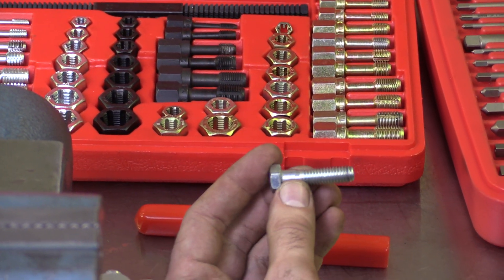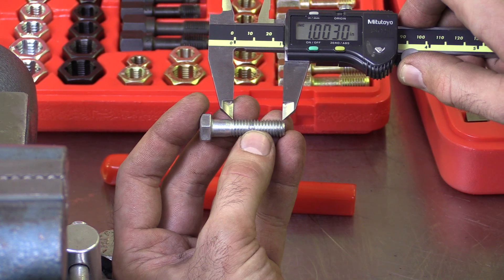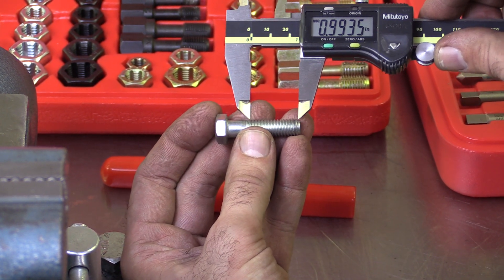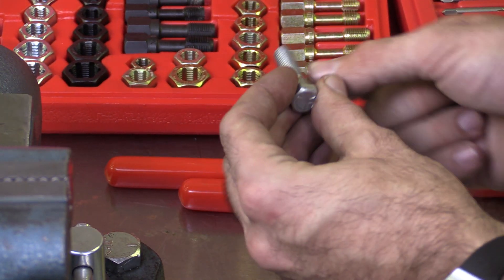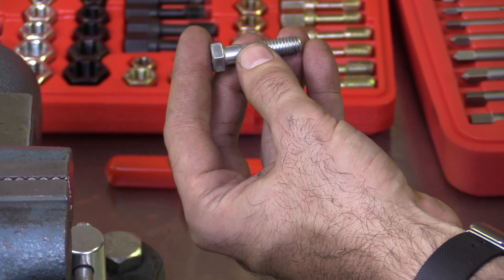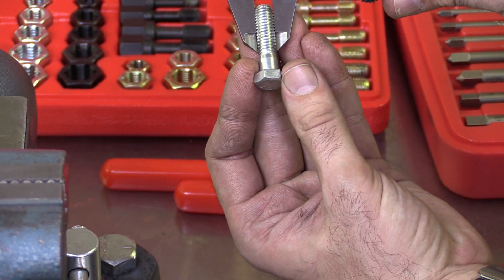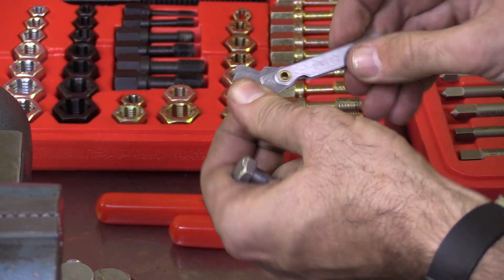We previously took a look at this bolt, and using our digital calipers, we decided that this was a 16 thread per inch fastener — a 3/8 by 16. Now, this is not the most efficient way to figure out what the thread pitch is. It's convenient for demonstration purposes, but really, if I had some damage on this and I was wanting to fix it, I would of course need to know what size it was. It may be appropriate to measure the outside dimension with our digital calipers and realize this is a 3/8. But then to figure out the thread pitch, we're going to use this thread pitch gauge.